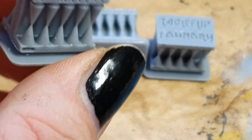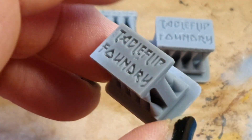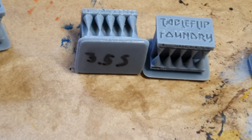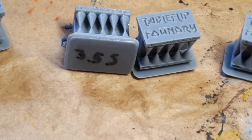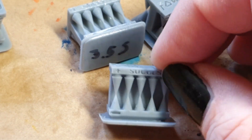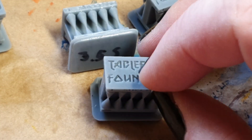The optimal print exposure should be around 2.25 seconds. This is how you determine the perfect exposure time for your printer. It doesn't need to be super precise — a little more exposure time is better for your supports. So I will probably stick with 2.4 seconds for my prints.